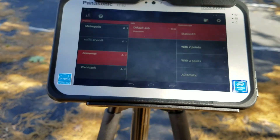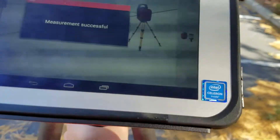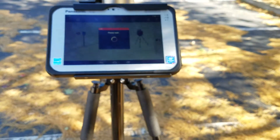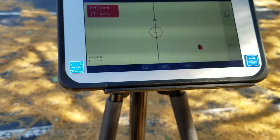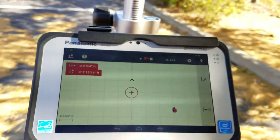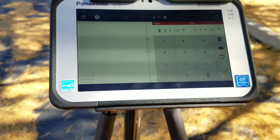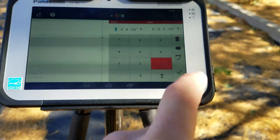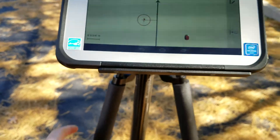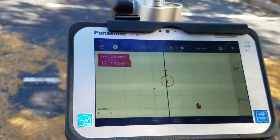You can also do this with two points. It really doesn't matter if you have your drawing in there or not — I'll go to my next point. Now you have your line. My zero-zero is back where I started. I can edit my line and tell it I want my line to be offset three feet north and my zero-zero to also be six feet to the east. Now my line is moved three feet north and six feet east from where I first drew it.